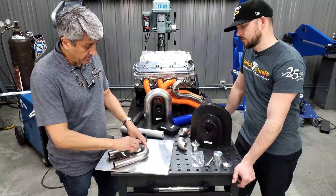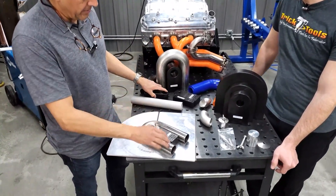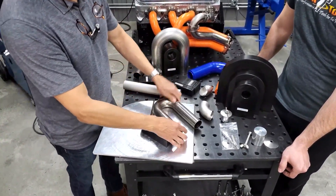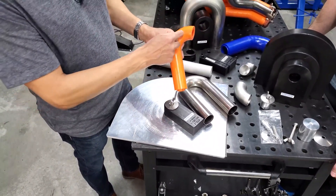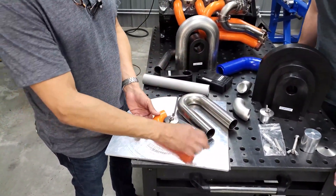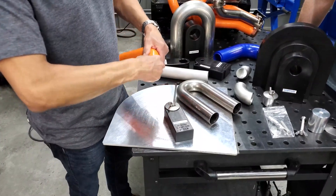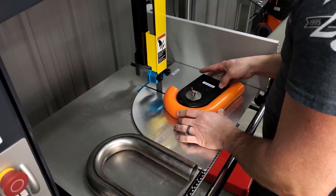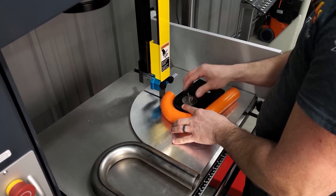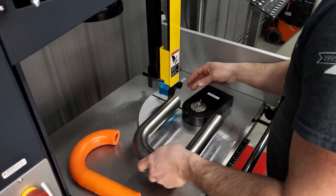Then a wing nut allows us, once we make the adjustment for the angle we need to cut, to bring the blade through here. The adjustment is very simple — no numbers. It's essentially recreating the plastic part that we have in any given model, based on our control sheet and number of blocks, and then just bringing it to where our blade can touch. That would be our adjustment. If we need to cut three inches, we make sure there's no gaps on the side, it's well-supported, it's laying flat, and then we just turn it until we touch the blade — that will be our stopper. Then it's simply a matter of replacing the U-bend and making the cut to create the part.